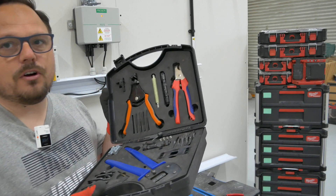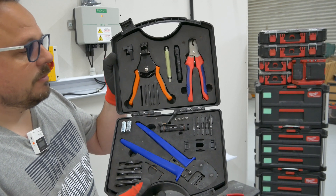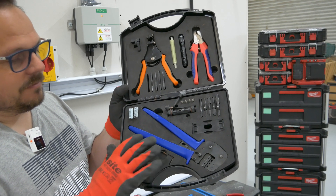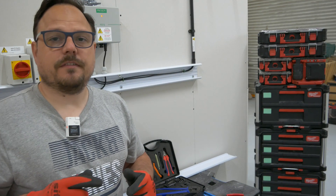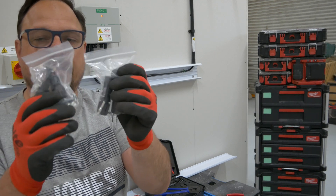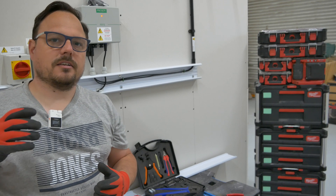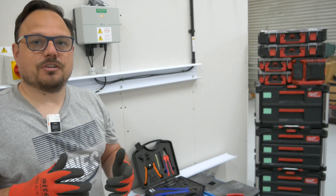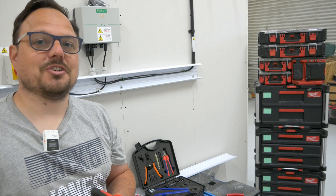There is also the Hi-Lec MC4 tooling — the little kit they do. I've shown it before on the channel. You've got some VDE snips to cut your cable, the stripping tool, and the crimping tool in there as well — a good quality ratcheting bit of kit. It comes with a few different bits and pieces for making off your MC4 terminals and tightening them up securely and safely. A point of note: if you're using MC4 connectors, don't mix your brands. This ProJoy came with a selection of MC4 connectors and I'm keeping those with it because it's important that the pairs do match up. When you get your inverters and batteries, they all come with plugs and crimps applicable to them — don't just cast them aside and use the ones you've got in your tubs. You do need to use the matching manufacturer's connectors. Apparently that's a big no-no with MC4 connectors, and as they are the things that tend to cause fires most often, it's worth taking note and doing it right at the outset.